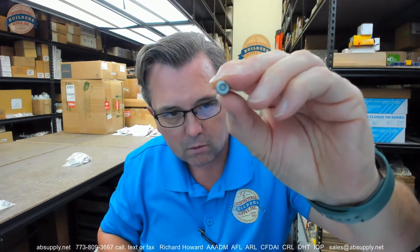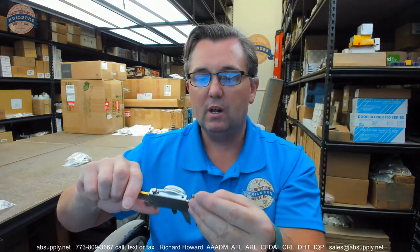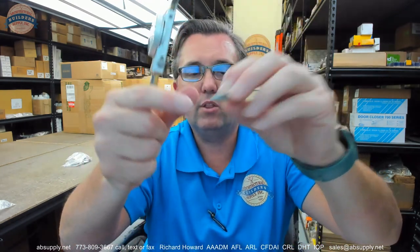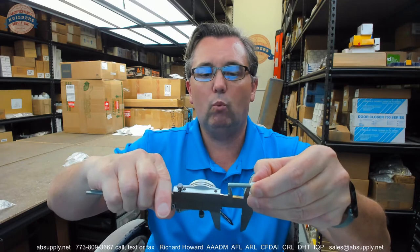We have two fasteners that are the shorter units. I expect that they are metric. The thread diameter is 0.193 inches, and the length is about 0.55 inch from the underside of the head to the tip of the bolt. Then the longer unit — threads are about the same diameter, 0.191 inches — and its length is about 1 inch, 0.99 or so.